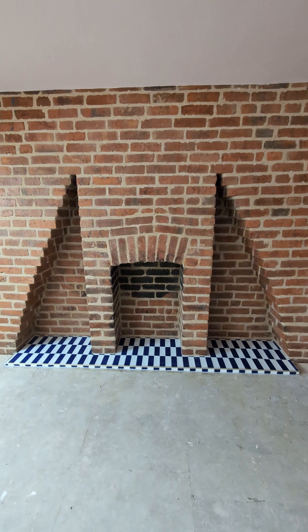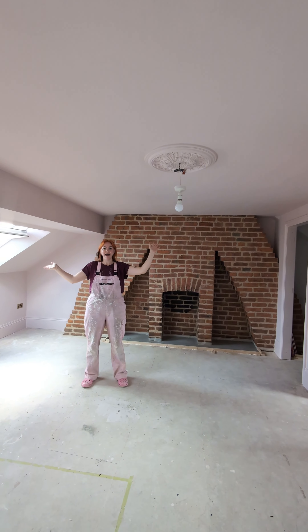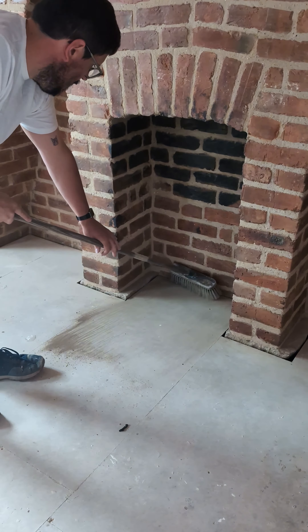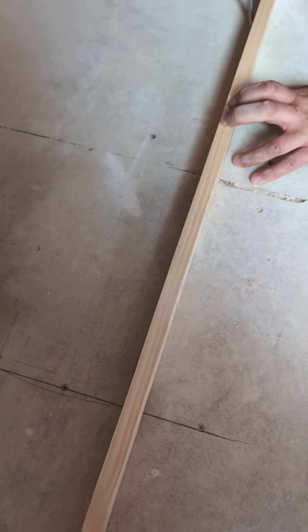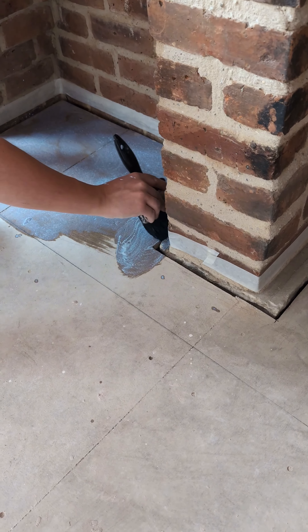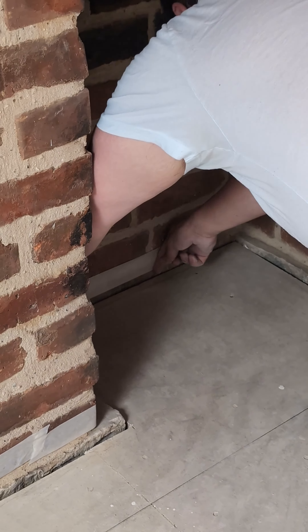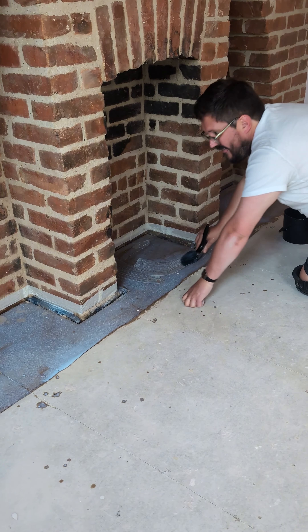We found there weren't many videos online on how to do this, so we really had to make it up as we went along, but I had a brainwave. Let's pour a self-leveling compound for the base and tile on top of it. We started by cleaning the floorboards and marking out how big we wanted the base to be. Then we primed it using leftover primer from our shower tanking kit — out of date, but who cares. We taped off the bricks too, because we spent far too long restoring them to just cover them in splashes.